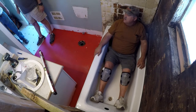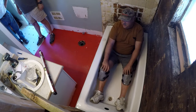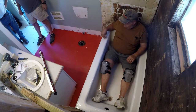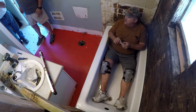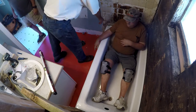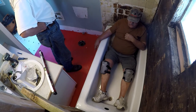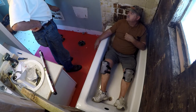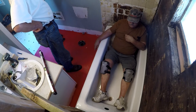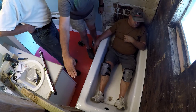I'm just enjoying my expensive tub and shower. Enjoy it for about two more seconds and then I'm leaving. Your two seconds are up. You're going to start the plumbing, and maybe Dave starts doing this. I've got to go meet the puppy. It doesn't look like we can get a piece a half inch behind here, Jeff. Just go right down to it — go right on top. Then you fill it. I would even maybe leave a little bit of a gap so you can get mortar splooshed in and behind there. So like a quarter of an inch. Never go behind the tub — that's a boo-boo. Never go over the lip.